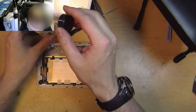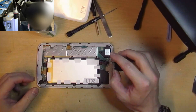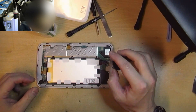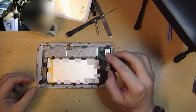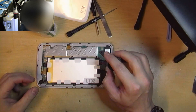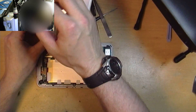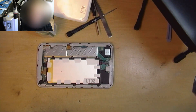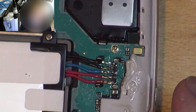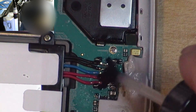We've loaded our brush up. You don't want it too thick, really — just start dabbing it round. This is just going to basically coat the wires. Let's zoom in there so you can actually see what I'm doing. You can see there, it's getting sort of a bit wet, a bit shiny, as I'm putting the conformal coating on.